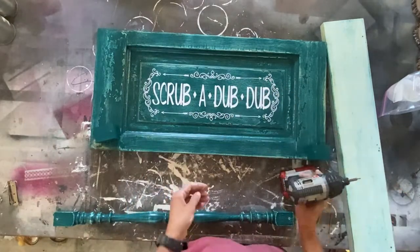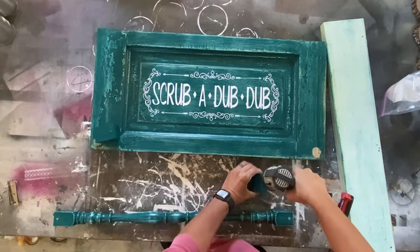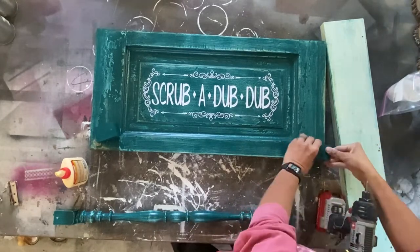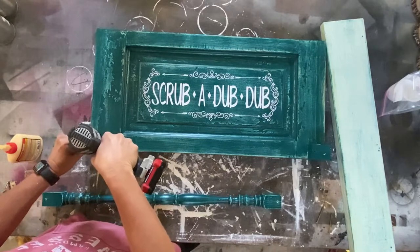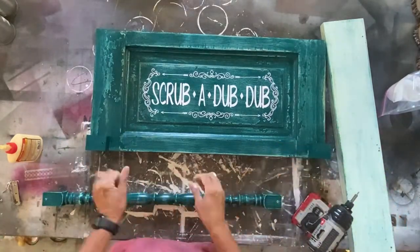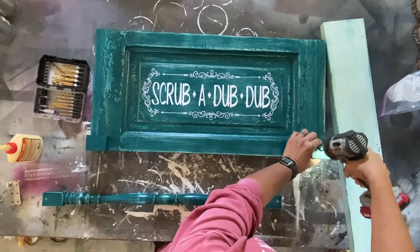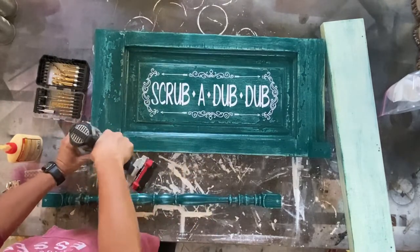Second try: I have my two-by-twos cut at two and a quarter inches with pre-drilled holes. I'm using trim screws because they're more slender, hoping that helps with splitting. I lay down wood glue, then use the pre-drilled holes to screw them down — first just one screw per side. Then I go ahead and add a second screw. On the left side, even with pre-drilled holes, the piece splits again. So I have a second split piece and I'm a bit frustrated.